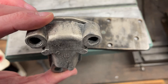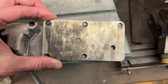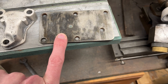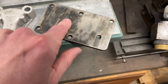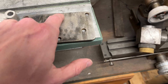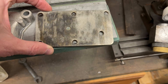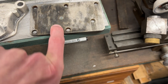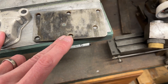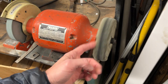This part worked really well. As you can see, it's sort of a dull silver now. This one, interestingly, I'm not sure what really went wrong - we're going to buff it up and see if it sorts itself out. It could be a combination of a couple of things. One, I used a panel degreaser - maybe that was incorrect. The other thought is I was hanging it with a piece of copper, so maybe the copper actually caused it - you can see it's got a bit of almost a coppery look around it. Or maybe there's extra grease in here that just didn't get removed. So we're going to try buffing it up at my dad's workshop with a buffer and see how it comes out.